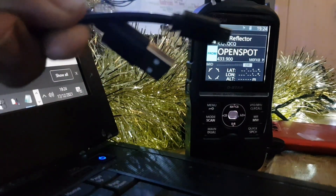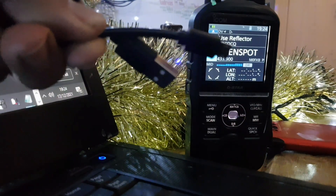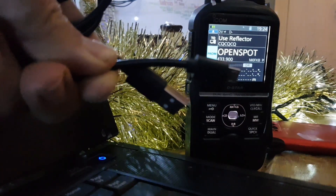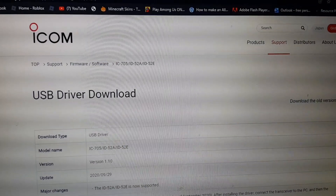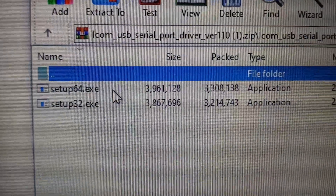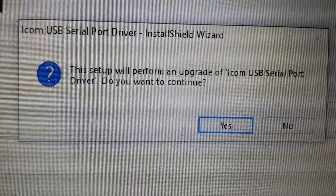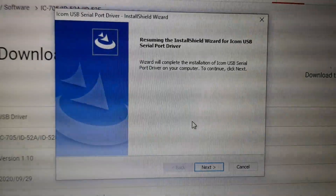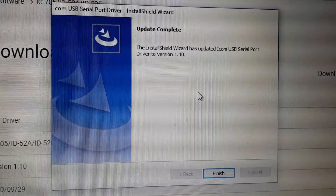As far as I can see, you can use any Micro USB cable, but look out for charge-only cables — you do want one that will pass data. I can't see that Icom have made a specific cable for this, but one that has screening or ferrite rings would be more appropriate. I'll put a link in for the USB driver download.